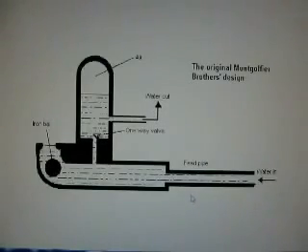This is the basic 1800s hydraulic ram pump design. This was a cannonball chunk of pipe — velocity increases enough and it slams shut here. It creates a pressure spike — a check valve here, high pressure comes in here. Air cushions it, stabilizes things, keeps it from blowing up, and starts the pump cycle over. That's basically what this is, but you don't need this valve and you don't need an air chamber. So the world's simplest pump — you can remove two parts.